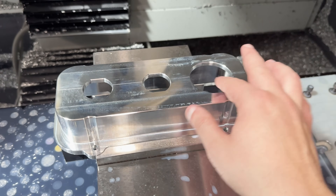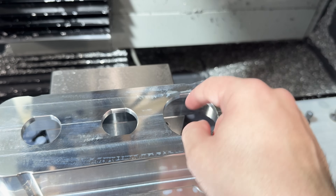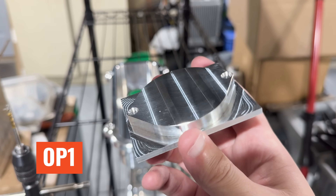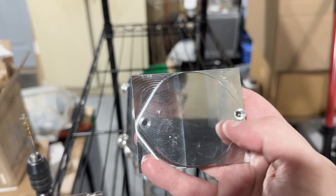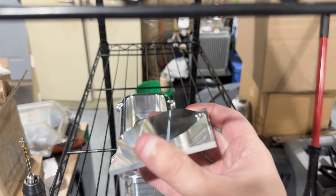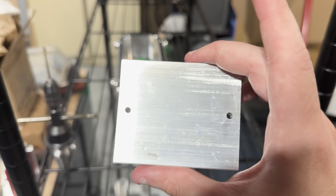Now I get to play with all the fun stuff. You can see there's a flat that's supposed to prevent the rotation. What I'm actually going to have to do is go in and recut the bore, drill and tap those two holes, and then chamfer the edge so that the sleeve can get pressed in. Here is op 1 — this is the outside of the sleeve that goes on the bottom. I don't have a countersink that small so I actually had to do those with a ball end mill. Here's op 1 — we'll flip it, put it in soft jaws, and I'll show you how I hold it in op 2.